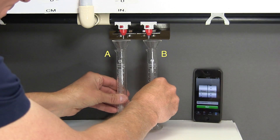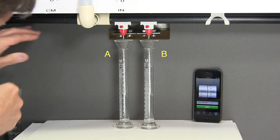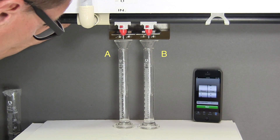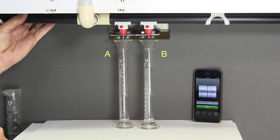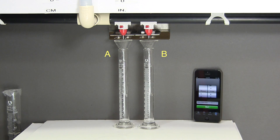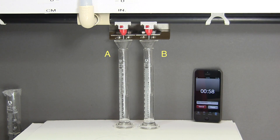The machine is switched into its side-to-side activation mode, and what we call the dynamic flow rate test is started. The side-to-side activation is designed to resemble a real bird's drinking behavior, which is peck-release-peck-release.